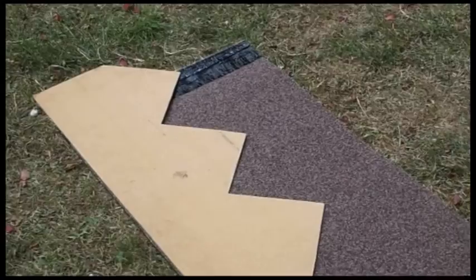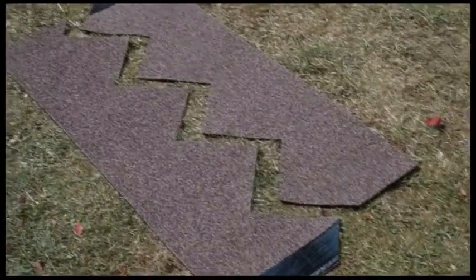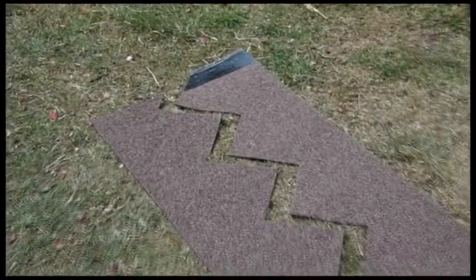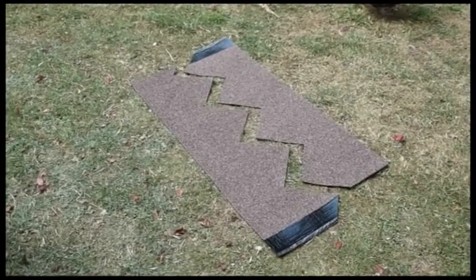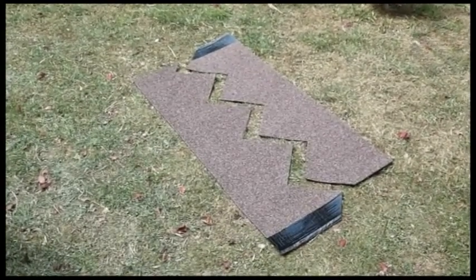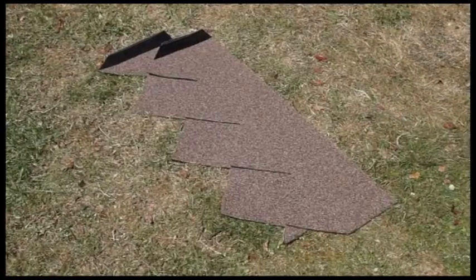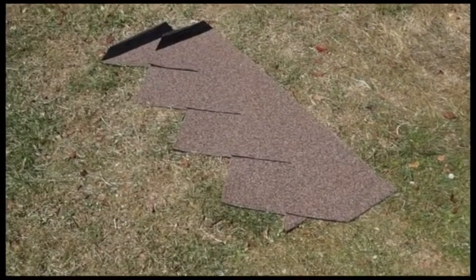Once cut, the two strips are essentially ready to lay depending on the width of the roof. It doesn't matter if you go a bit too far when cutting, because any small cuts will get sealed when the felt is stuck down. The strips are alternated to get a tiled effect and then attached to the roof by gently heating with a blowtorch, which burns off the protective plastic layer then melts the tarry backing. This then sticks really well to the roof and previous layers of felt shingles as you work up the roof from the bottom to the top.